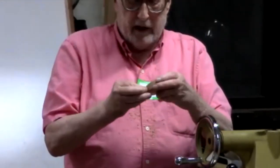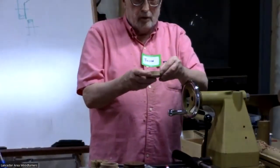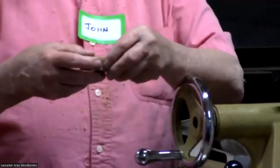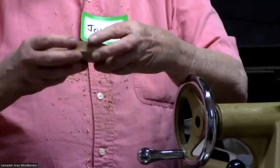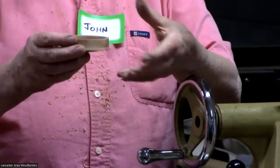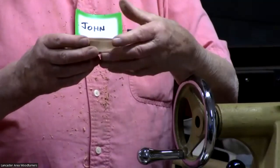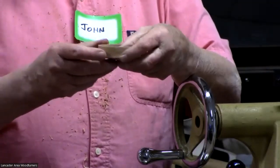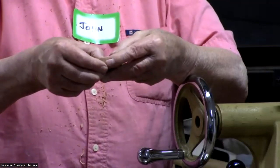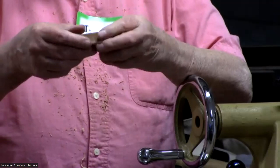Now I usually do this with a long stack of magnets as a tool. They're there. Okay. I do not want them protruding where they mate. I want them recessed a little bit. Several reasons for that. One is I may need to adjust the fit of this box, but the other is that when they scrape together, they scrape. They're hard, very stiff, very brittle, and when banging around, they'll chip. And I don't want that. Also, they're strongest, of course, when they stick together metal to metal. I don't want that either. I want a little bit of an air gap so they don't grab metal to metal.